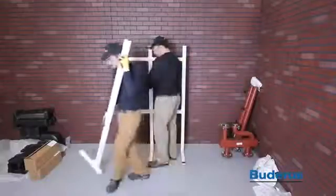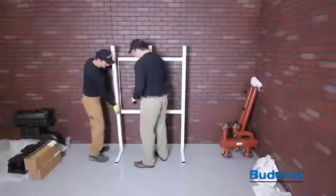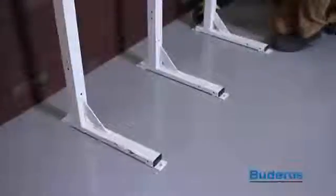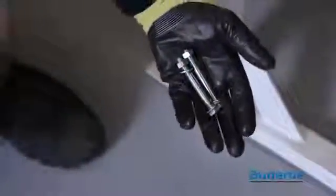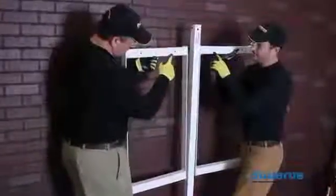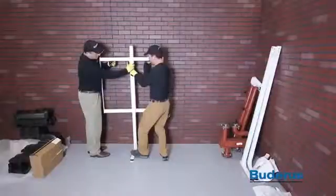The GB 162 cascade system utilizes a floor-mounted rack system for hanging the boilers. The rack system must be installed on a flat, level surface. Fix the support frame to one upright support using 2 8mm by 70mm bolts and nuts provided. Be sure that the pre-drilled holes for the boiler hanging bracket are positioned at the top.